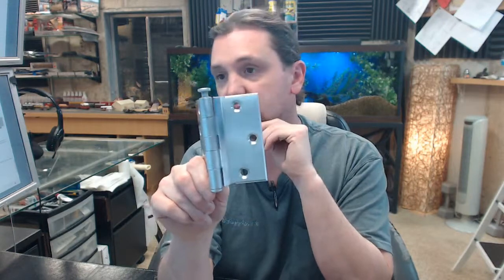Obviously a much more common application is the 4.5 inch — that is going to be a hollow metal door and a hollow metal frame where a hinge plate has failed. Or you have got a frame you want to stay in place, you can't get your hands on the door that fits into the hinge locations, so you grab whatever door you can purchase and those hinge locations won't line up. That is another use for half surface hinges.